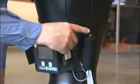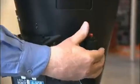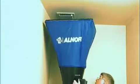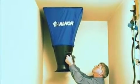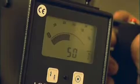On the side is a red button that will lock the reading into place, so once you've taken a reading you can bring it down and actually see the same number. Here we're going into a small bathroom and we're going to put it up against the ceiling. This will seal itself because of the black foam around the edge. With a tight fit up above, all the air going out of the fan is being pulled through here and it's about 50 CFM. Push that button to lock the flow, then bring it back down and read it more comfortably.